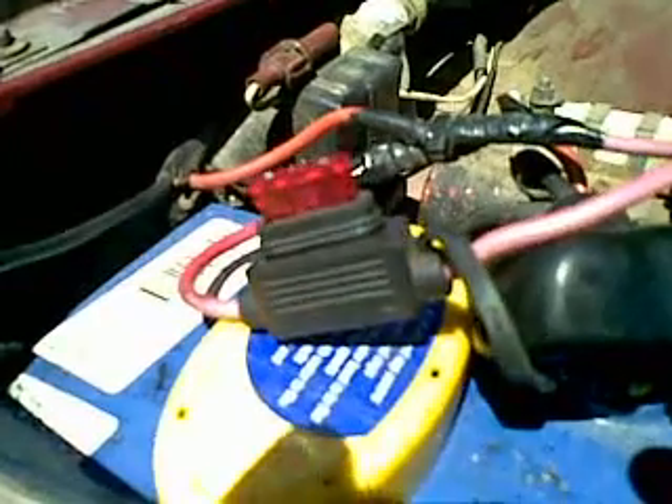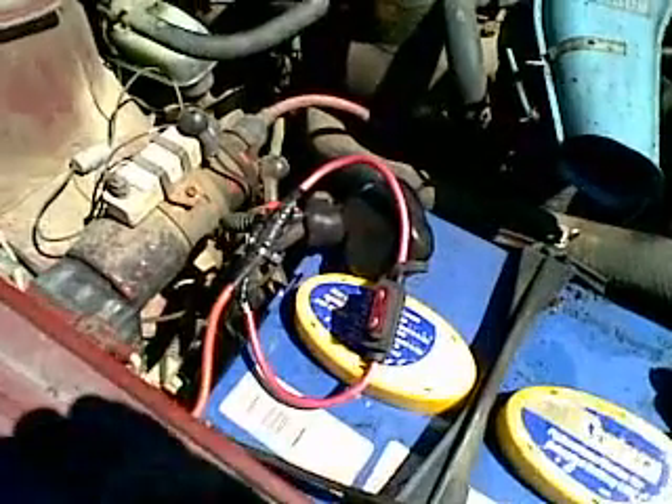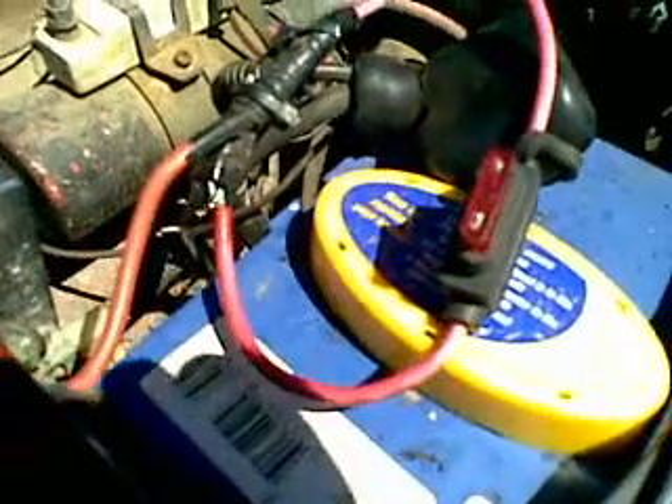We have a fairly urgent safety warning update. If you're fitting a Sunfoil, you must fit a fuse — this fuse between the battery and the charge controller. The purpose of this fuse is so that if anything happens to the wire between the battery and the charge controller, you're not going to cook the wiring. If it heats up, all the magic smoke comes out of the wire and it'll never work again.